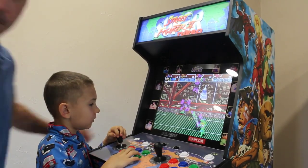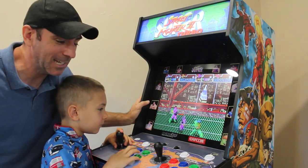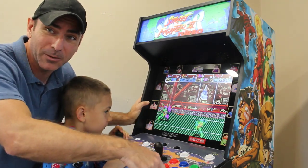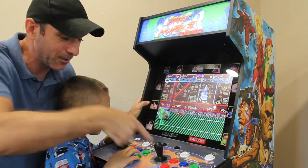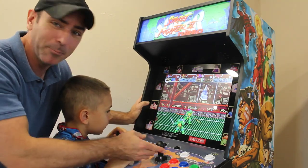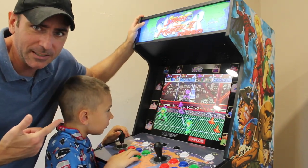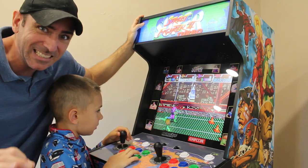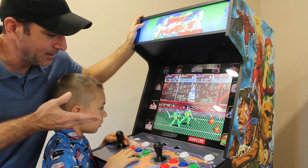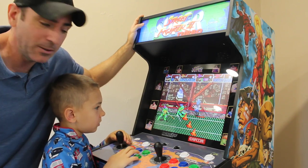So we have a little issue. When recording this video it was my first time doing it. We started playing and found that Ninja Turtles is a four-player game — this ends up being player 1 and this one is player 3. The problem is the joystick is not mapped properly: up and down is left and right, and right and left is up and down. Not the end of the world — this was just to see if I can get another interface going. I plan on getting RetroArch installed where I can map out buttons and joystick. Depending on your cabinet you may or may not be able to use this.